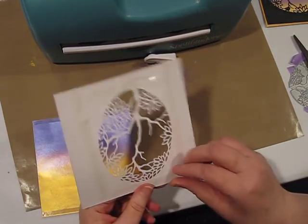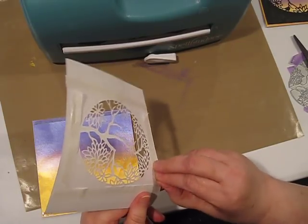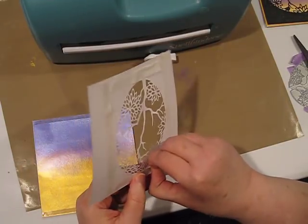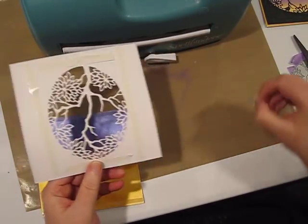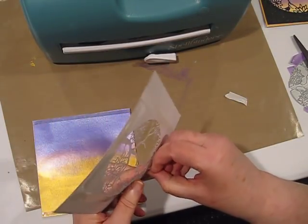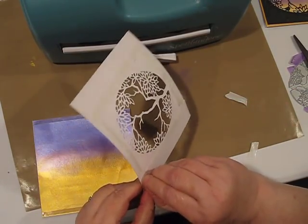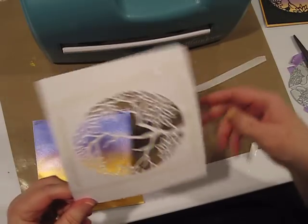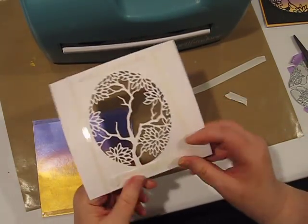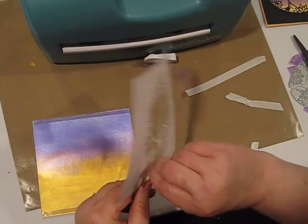I'm going just a little bit over the edge. This finger lift tape has a strip of glue right down the middle, but both sides are just paper, so to get my glue right on the edge I need to overlap just a tad — and there, now I'm right on the edge with my actual tape. Now we'll peel the tape. The paper is going to be a little stickier about coming off, so I'll come into the center and tear it both ways. If it doesn't lift quickly and easily, come to the center and pull it back.